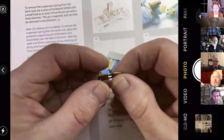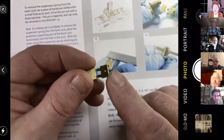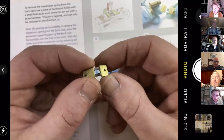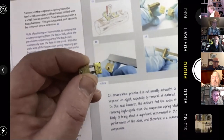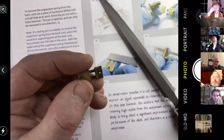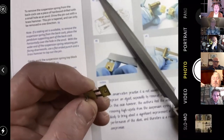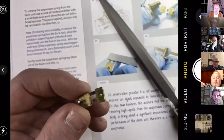What we show you is: you can see the top block pinhole is punched through — on one side there's a little crater, and on the other side it's been flattened out a bit, but it's usually too tight. So we advise people to take a file. This is a really important point for beginners: when you want to file something flat, the natural instinct is to clamp it in the vise so it's firm, and try to file it flat — but you can never get it perfectly flat that way.